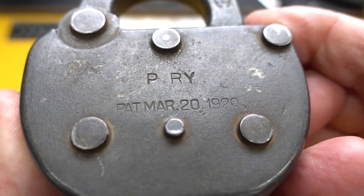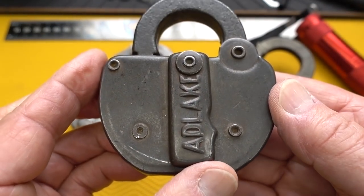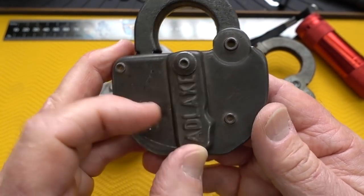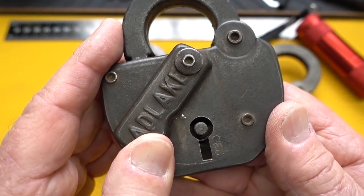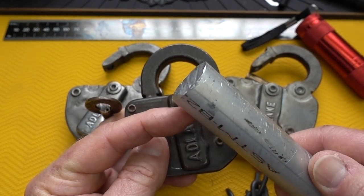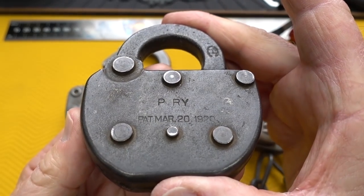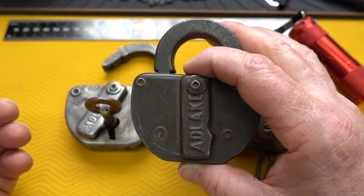This one also works beautifully. Particularly when a third one rolled in — I thought, now I really have to get on this. I need to come up with a key that'll fit all of these. This one did not come with a key. Very cool — March 20th, 1920, Pennsylvania Rail Yard, I believe. When you flip it open, there's a third style keyway, and this one is more traditional. So I've got three of these things now; they all have that same ring. Rather than mess up a working lock that has a key — particularly one this old — let's attack this guy. I'm going to make a tensioner that will fit around that steel ring, machine it out of aluminum because I kept breaking wires.